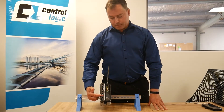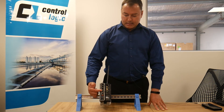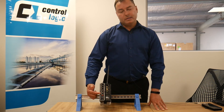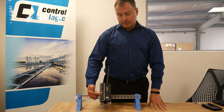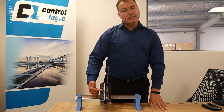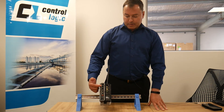Above that we have two Ethernet ports. They're usually on two separate subnet masks — the first is connected to the PLC network or control network, and the second is connected to the SCADA network.